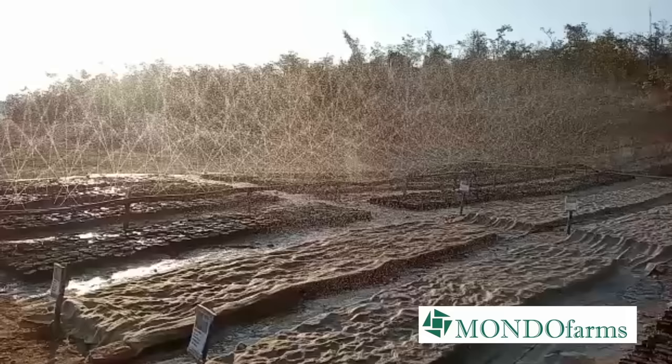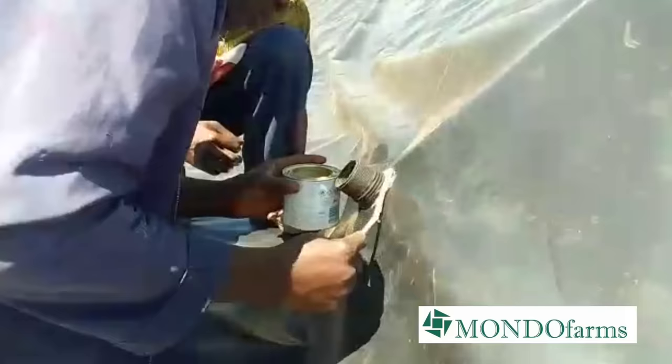So, as we were constructing, you saw that part where we left a space on the sides for what we call the outlet. It's one of the words we use here on the farm, the outlet. So we make a side and then at the bottom of the reservoir, we're going to put a special type of hole and then have water flow out of that. At Riverview, it's up to about 10, 12 meters above the level of the rest of the farm. And we've been able to achieve massive pressures there, enough to drive a pop-up sprinkler and a rain hose, if you can imagine, without a booster pump. So part of the last jobs that we did in the days following the installation of the pond liner was to come back in and install the outlet.